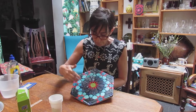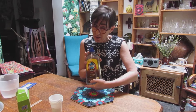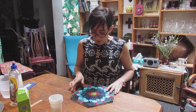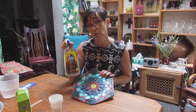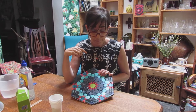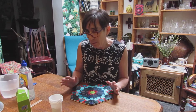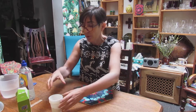This sample tile has got a floor polish — Pledge Revive It — which I'm going to use to give it a sheen. It's only available in America so although it's only about a fiver, you're paying a lot for delivery, but it seems the easiest way to get just a little bit of sheen — not a high gloss, just a bit of a sheen. What I'm not sure about is whether I should apply it before or after I put the grout in. It would be nice to apply the Pledge while it's all still horizontal, but then I'd be grouting after the Pledge is on. Grout is ever so slightly abrasive, so while I'm rubbing it into the grout joints it might end up removing the Pledge finish. That's what these experiments today are about.